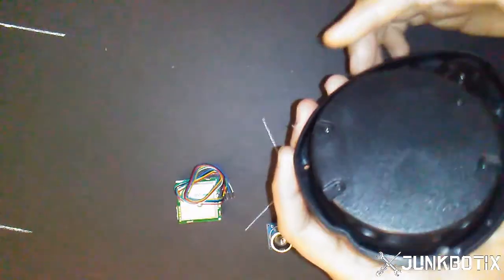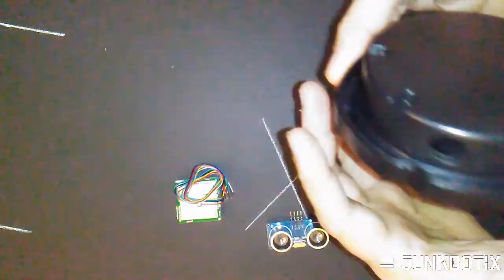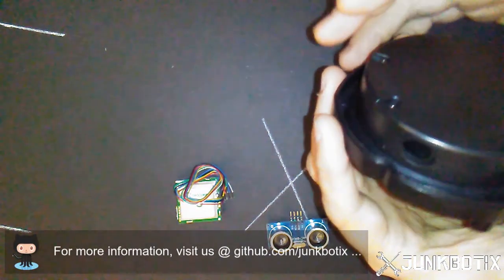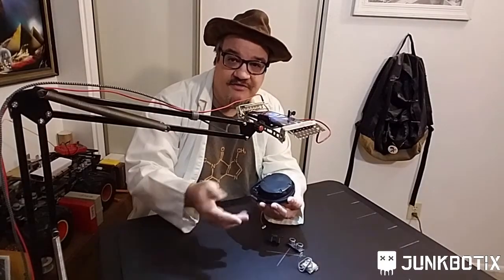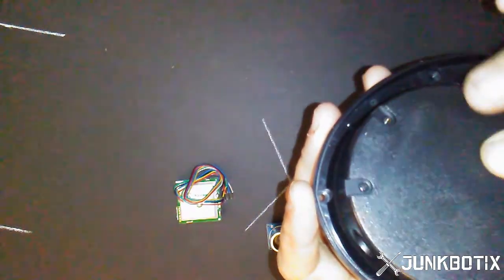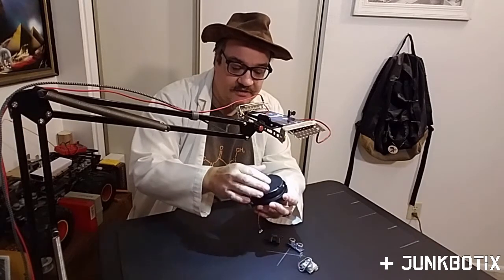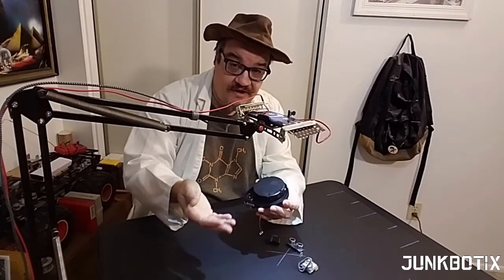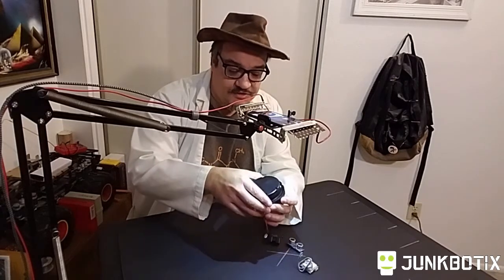Finally, probably the most unique of these sensors: this is a LIDAR unit from a Neato XV11 or XV21 vacuum floor cleaning robot. It uses something similar to the Sharp IR sensor — a laser sent out one hole and a signal received back through the other, using parallax distance measurement. It spins in a 360-degree circle and measures out to whatever obstacles are around. Its problems are that its range isn't very far, it's kind of slow at only about 300 RPM, and it doesn't work well in sunlight — it's more meant for indoor use.